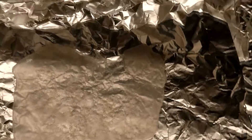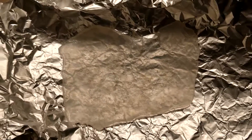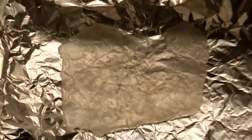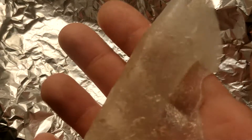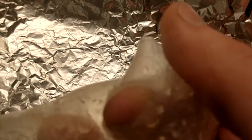And here are our results. It's been a few days since I made the last bit of this video. I've helped the drying process along using my hot plate, and this is what we get. This is a more plasticized thermoplastic starch. As you can see, it's very rubbery, very soft, and very flexible. It has a little bit of tensile strength — you can pull it apart and everything.